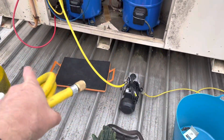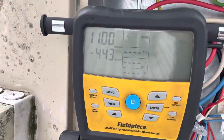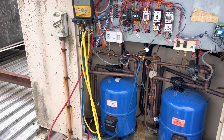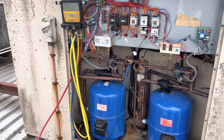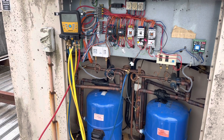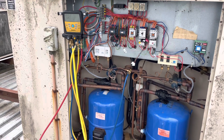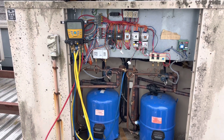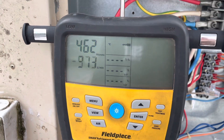We've currently got the unit back on now. It's about 10 to 12, so we're going to have some lunch and leave this thing running over lunch. Come back and see how it goes — it seems like it's already tracking pretty well. I'm pulling through my gauges. If I feel the need I'll put my Testo probe and back-stat on just to make sure. Like I said, this job is one where we're basically just doing it to get them up and running in the interim until we can come back and replace it. I'll still do my best, but within reason. It's pulled down all right — that's actually pretty good.